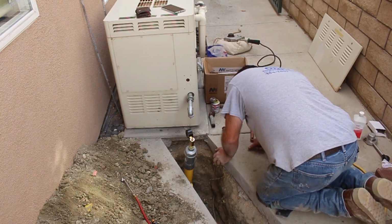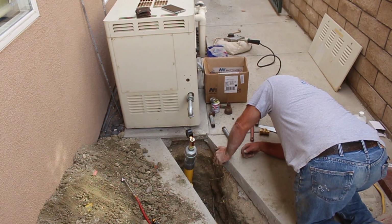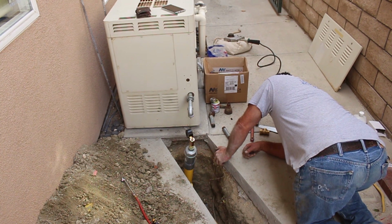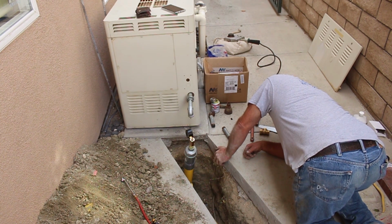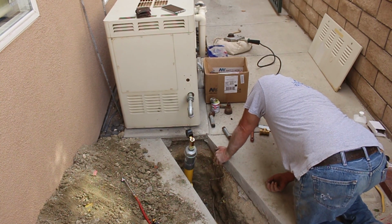Now, as you can see here, I've hit it with the air compressor. I brought my gauge up. And now we're going to see how she holds. I'll come back in the morning and see what she looks like. Right now, it's looking really good. It's holding tight. And the thing about just air is, if it is leaking, you can't smell it leaking, so you've got to have the gauge on there. That gives you a good indication whether it's holding or not.